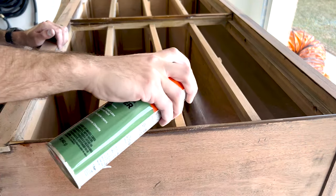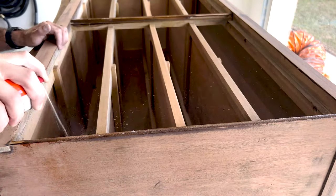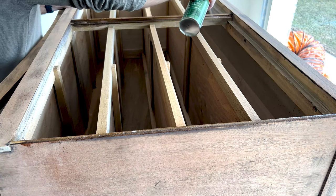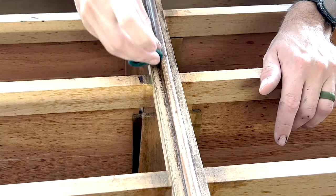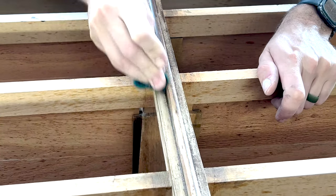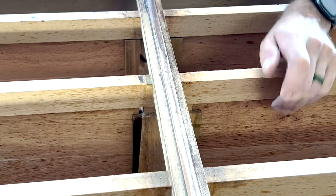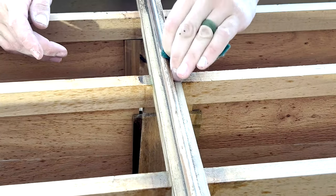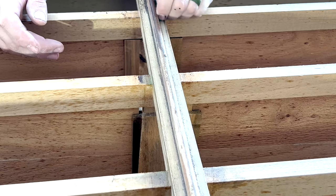Okay, so this is just a little bit of citrus strip and a rattle can. I like to keep this. It's really convenient. If you're going to do furniture flipping in a shop like this, I would say keep BIN primer, a can of citrus strip, and a rattle can of spray paint. Basically, that's the only thing that I keep in aerosol form. Just a helpful tip to me anyway.